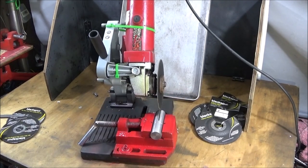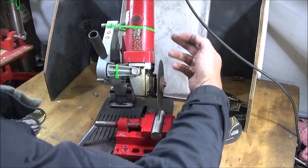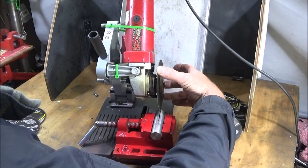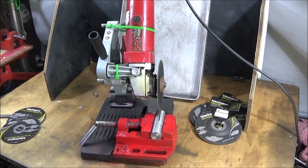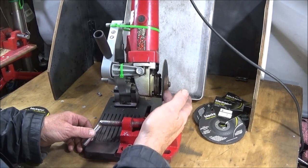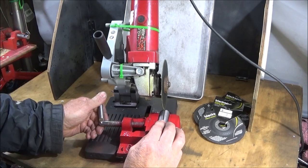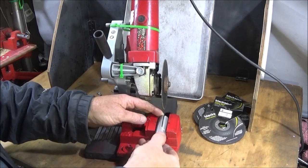If you're doing this in an enclosed area, make sure you have a metal tray behind to catch the sparks, particularly if you don't use the guard on the angle grinder. The other day I was using my belt sander and wire wool was hanging in front of it — within seconds the wire wool caught light and I had to work very quickly to put the fire out. I've also had my clothes alight before when using angle grinders, so they're quite dangerous if you don't think about things.